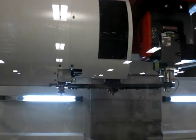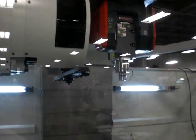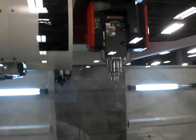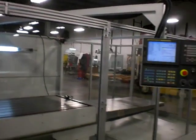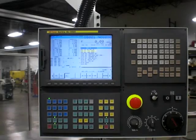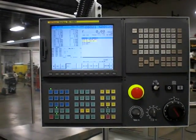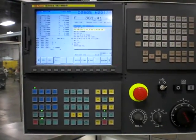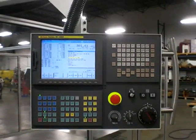The standard 24-tool arm type tool changer is combined with a huge table. This model features the GE Fanuc 18i MB5 control with full 5-axis functionality, rotary tool center point compensation, inverse time, and 3D tool nose compensation.